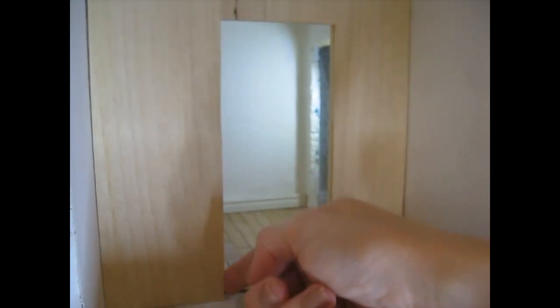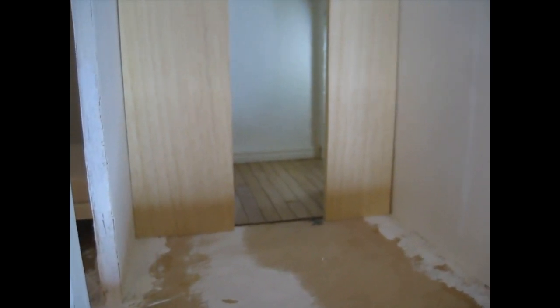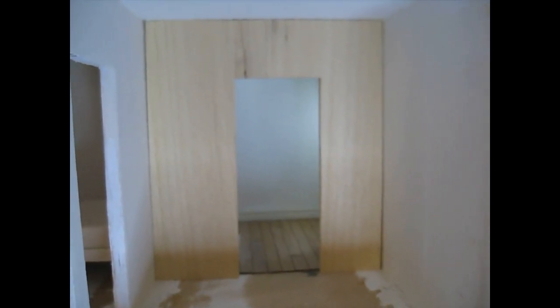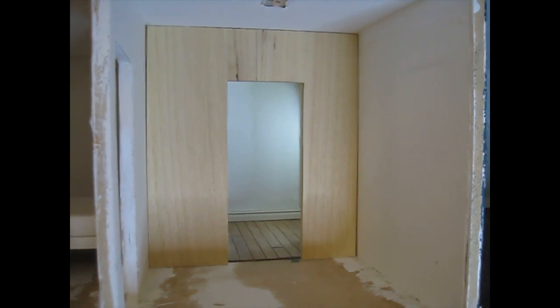And there is the false wall in place. I trimmed along each edge of the door so I've now got a nice flush surface there when I attach my door frame. I just had to do a little bit of sanding along the top edge and the bottom edges to get that to glide in more smoothly. That's a really nice fit now and I'm really pleased with how that's looking. I'm obviously not going to attach it yet because I need to finish the back hallway and build the door into the guest bedroom. So I'm going to leave it here for today.